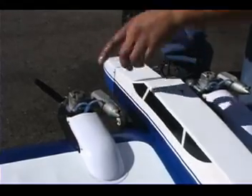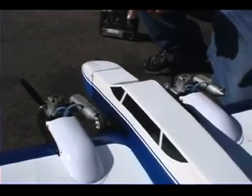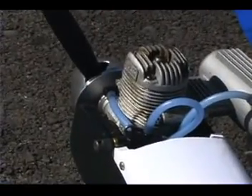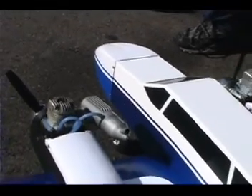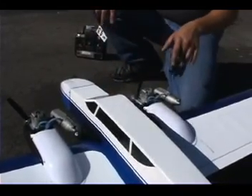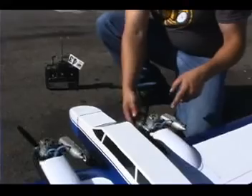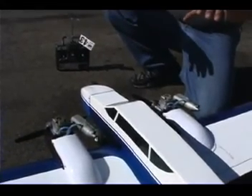This is a two-cycle engine, but it doesn't fire every single time it should. At low RPMs it actually fires every fourth or sixth cycle, and the power stroke is much faster than the other strokes. So you have to take an average of all the readings — a cumulative average through a circular queue, which is easy to do with the program on the Basic Stamp. After both props have their averages taken, that's compared. The Stamp has built-in commands to read the throttle-position stick signal and convert it into a desired RPM, then it compares the desired RPM to the actual turns on each prop and individually controls each servo so the motors attain the desired RPM.